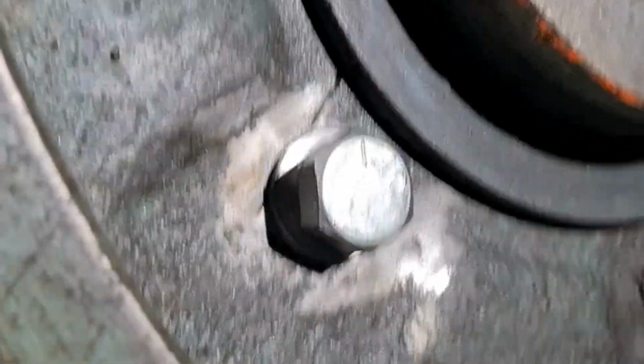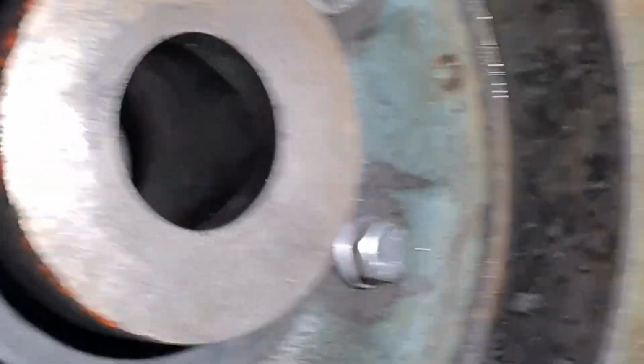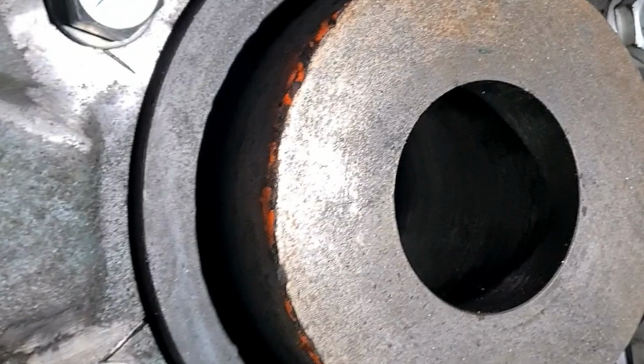Again, another thing that has come to light, I will have to take the drum off and take it all to bits from the wheel hub, because in there is the bolt holes for the wheels, believe it or not. So the bolts will have to go in first, and because they are just nuts and bolts, and another one here somewhere. Look. So they will have to go in first, and I'll put it on a wheel, and then what I'll do is I'll set to and do a bridge from bolt to bolt, so as they can't spin, because I'm going to have an awful job getting a spanner in there. So yeah, that's that job. So we're going to offer it up in a few minutes.